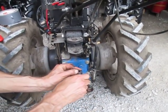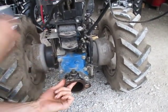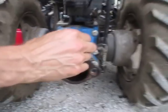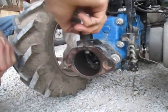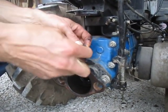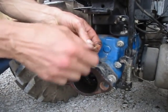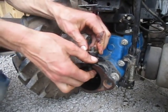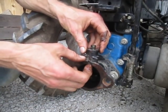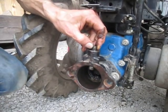The other thing that can happen is when this thing pops off out in the field - particularly when you're out there mowing and something catches it and this gets ripped off and you don't find it anymore - is the pin drops a little extra far and this washer gets lost. The washer just pulls up off the top of this pin. Now this pin is kind of messed up - it's got some burrs on the top which are keeping the washer from coming off, which is actually a good thing. But typically the washer will just fall right off the top.